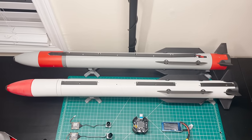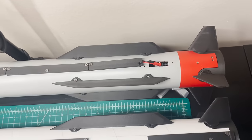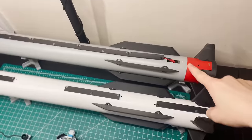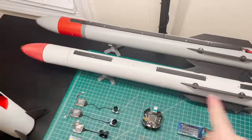We're also going to be assembling the raceway cable. So there's a very large cable assembly that lives underneath these 3D printed raceway shrouds. On the Block 2 version, it only has six wires in it. So there's four servo data lines and then servo power and ground to run all four of these servos in the back. When we run with a booster, we need a whole bunch more.